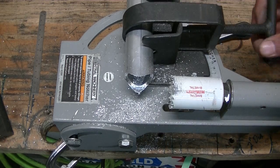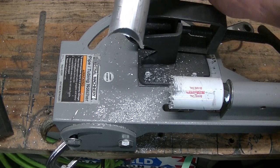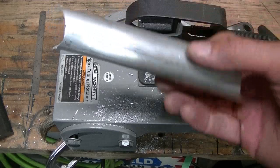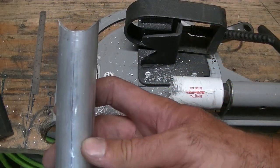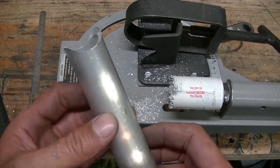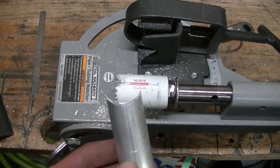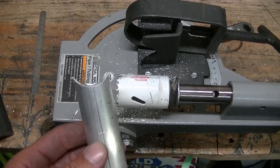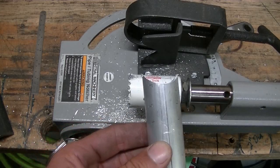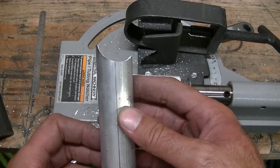Take a look at our cope, and that's looking very close to perfect. Right, there's a little play in the arbor and some other factors that I'll look into, and I'll see if it is just the play that gets out there. It's got maybe a good 60 thou I would think. But already it's looking a lot better than the previous one, which was way off.